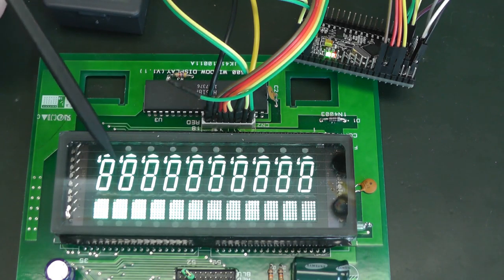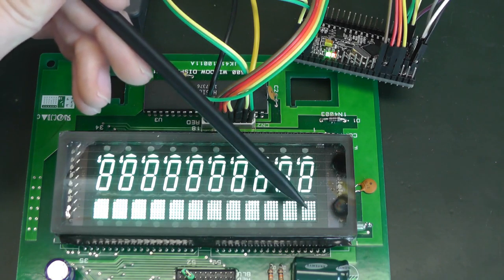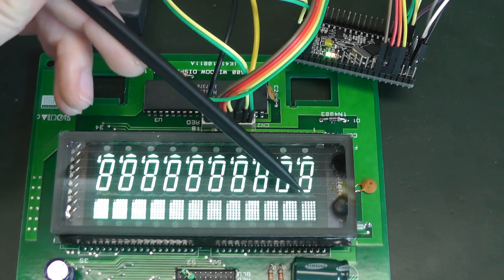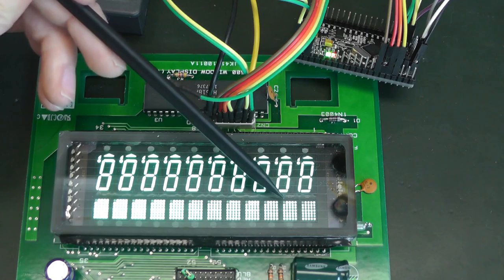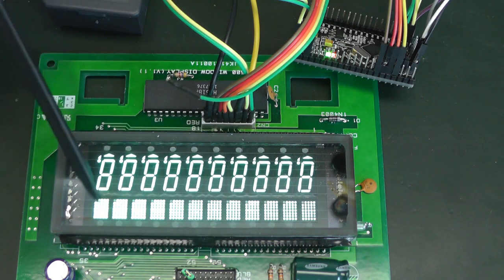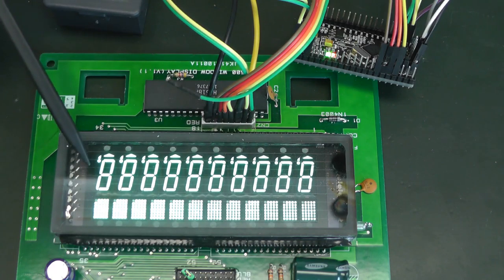One advantage is the low number of pins, because you don't have to control all the segments, but you first control which grid you want to enable, and within this grid you can individually control the segments. And if you pass to the next grid, you can control the segments another way. But you have to go through all the grids to enable all the display, meaning that you can only light up one grid at a time.